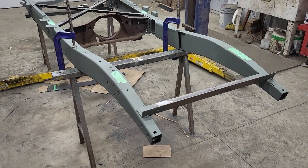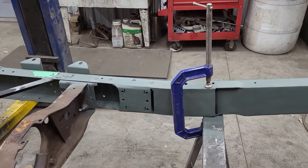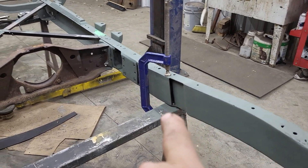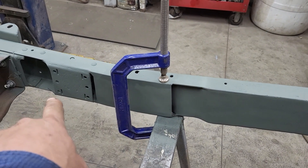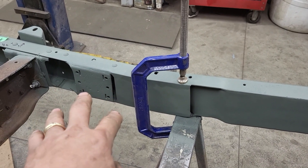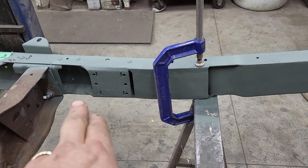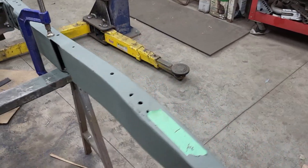So what did I do now? You can see where those plates are dipped in and welded on. I welded on and continued the process to the brake/clutch mount — which I'm going to keep. Yes, it's got a rivet there and there, but I welded that on, welded and finished that, and primed it with the self-etching.